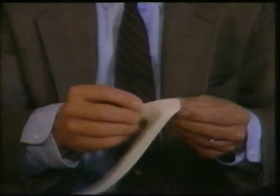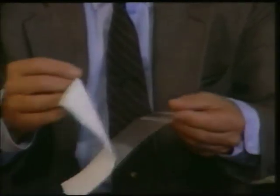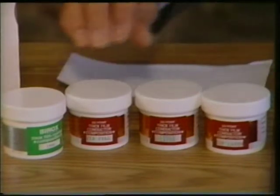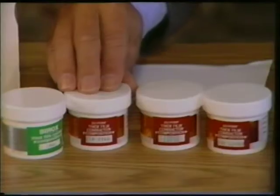This flexible, white composite material is a green tape dielectric, so-called because, as supplied, it is unfired or in the green state. To protect it during shipping and storage, it is cast onto a film of mylar polyester for support. Besides the tape, there are specifically designed conductor compositions: one that forms the top layer, another the inner layer, and the third the via fill. These conductors are available in gold, silver, and palladium silver. All compositions are specifically formulated for compatibility with the tape and with each other.